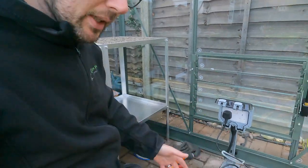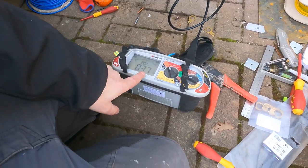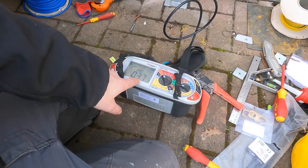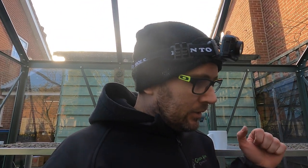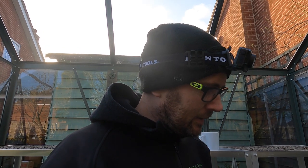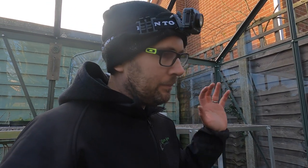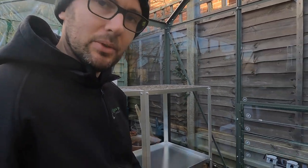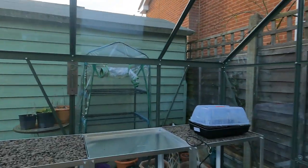So Jack has wired all that in and we're just testing it now. My R1+R2 is 0.36 ohms on there. We've fitted the RCBO at the other end. I just need to do my insulation resistance test, and yeah — 6mm is a bit big for going into there, but it gives me flexibility. The run doesn't actually need 6mm, but as I said originally there was going to be another DB in here for other bits. I'll rattle through those tests and get it all sorted. There's also a little light inside just done.